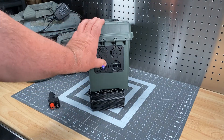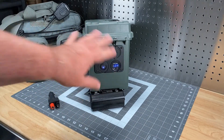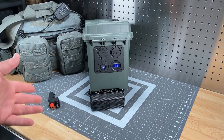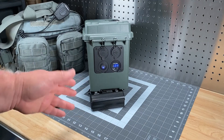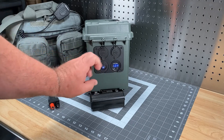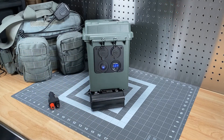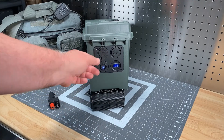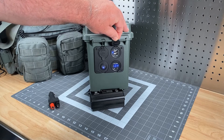On the front panel we have a main power switch — I can turn that off and there'll be no power going to any of the terminals or components. I have a voltage meter here. A lot of these parts come off Amazon. There's a common cheap type with a domed front that usually comes in a set of three, but the gauge itself is fairly inaccurate. I went with a PowerWorks unit — a little bit more expensive but worth it. Moving up, we've got our USB charging ports: a 5 volt 1 amp and a 5 volt 2.1 amp.